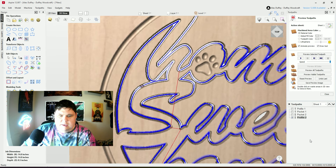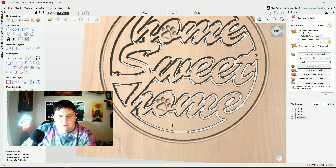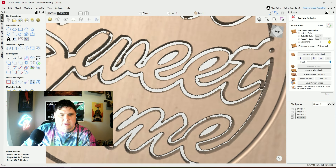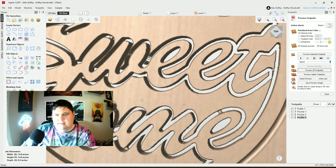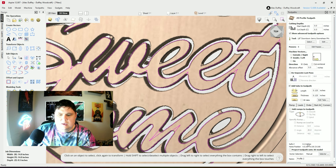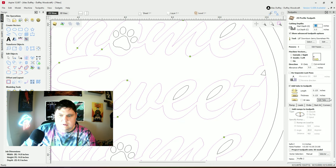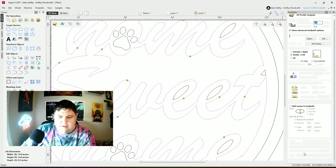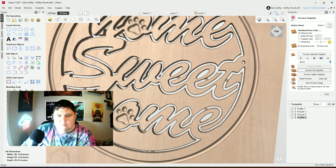I could sand them — MDF is pretty easy to sand. That looks much better. Each one of these little pockets has its pieces and its tabs. Here are a couple more inside the group — I'm not worried about those, those will get flicked off. But these E's and the T right there need to be adjusted. I'll edit my tabs, add a tab, add a tab, and add a tab, then recalculate. There they are — that should hold those in place just fine.